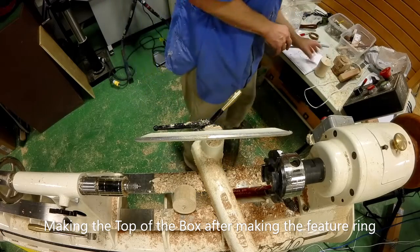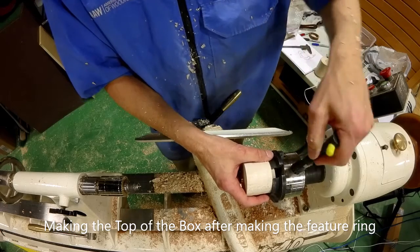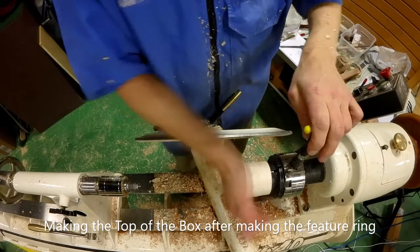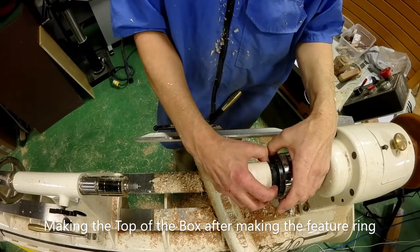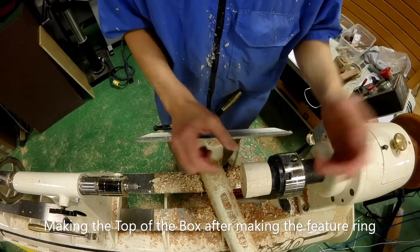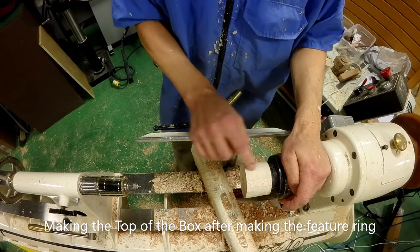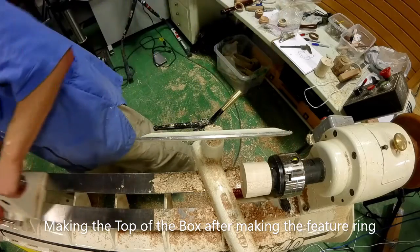No, first the top, then the base. If you have a chance, get tenons that are close to the opening angle. I think that's the most important part, other than it being a better fit on the jaws, which I don't think is that critical. But really, having the jaws inside gives you more safety in using the tool on the rest of the wood. Don't need that anymore.